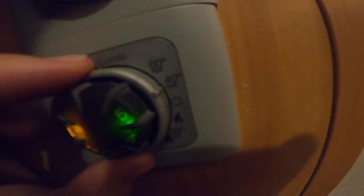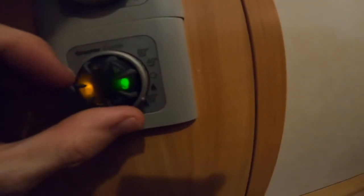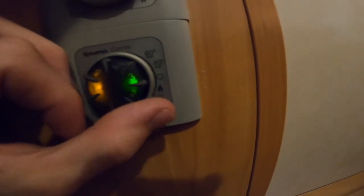Below the source selector you've got off in the middle, 60 degrees for heating your water alone - normally for dishes - and 40 degrees for shower water. The gas flame setting is heating on its own. Then you've got heating plus 60 degrees for heating your water. The thermostat goes from one to five: five is about 30 degrees and two to three is about 15 degrees.